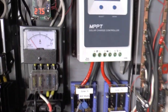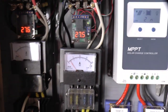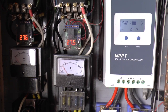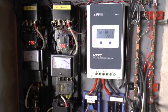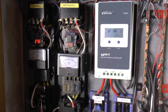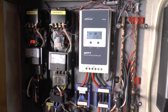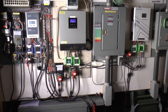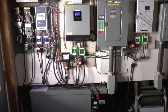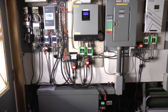Oh yeah, the windmill has contributed a little bit, a couple of amps. The windmill's on bypass because they got that set for 27.5 or 6 volts, so it's on bypass going to the dump load. Just a quick video of how things are going — thanks for watching, see you next time, bye.